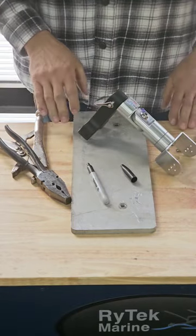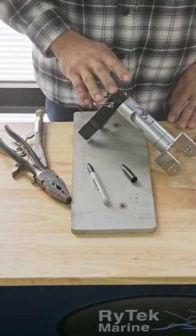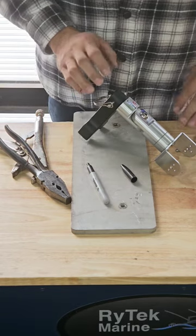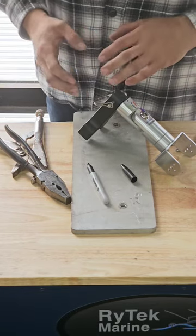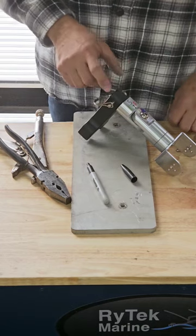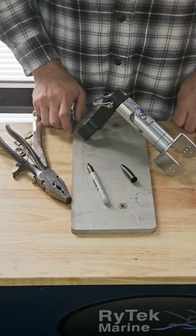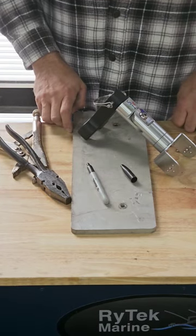So those are two options for setting up the pin. You really only have to do this if you're buying a connecting rod separately from me, because I physically can't match that individual pin up to the connecting rod. That's how you set up and tweak the pin to make it all work for you. Thanks a lot guys.